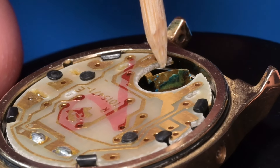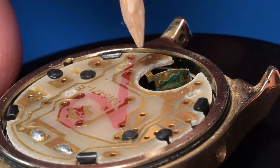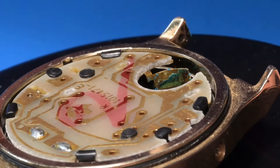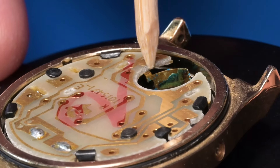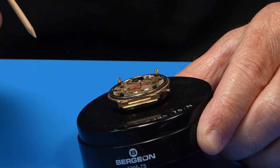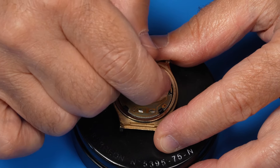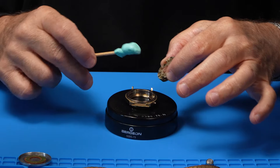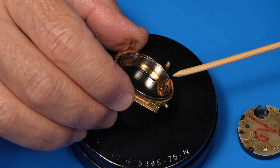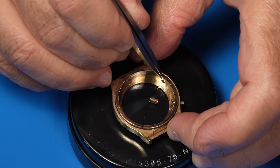New batteries are on order. There's a copper battery connector and there is some green gook on there. It doesn't look bad from this angle, but we definitely have a little bit of cleaning up to do, at the very least just to make sure that's a good contact on the positive sidewall of the battery. I'm going to use my Rodico on a stick to see if I can lift the movement out. Well, that may have been one of the problems — it looks like that spring was not against that little pusher.